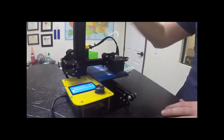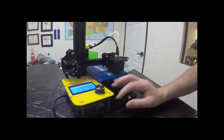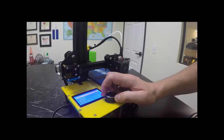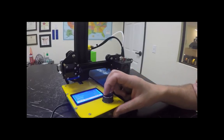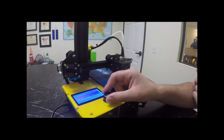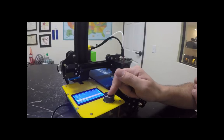And now what we're going to do is raise this up so we can load the filament in. To do that, we're going to tap the button. Then to get to those controls, we're going to go to controls and tap that. Then we're going to go to move axis inside of controls. Do you see that? Tap that. Are you with me? Okay. Then move 1 millimeter and tap that. And then we're going to move the Z right there. So go ahead and tap the Z